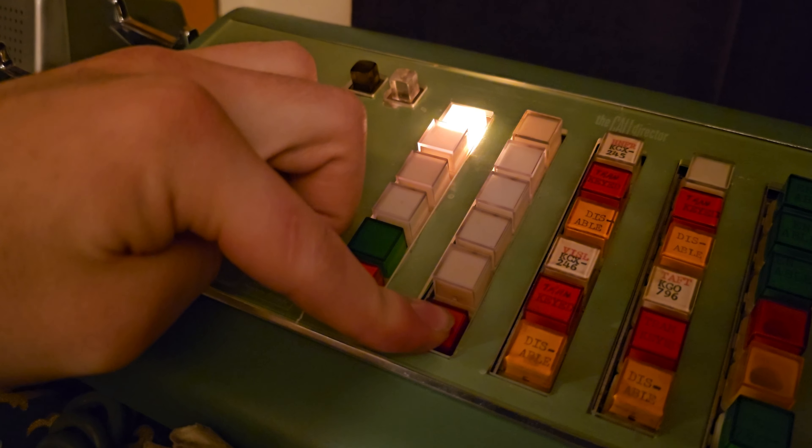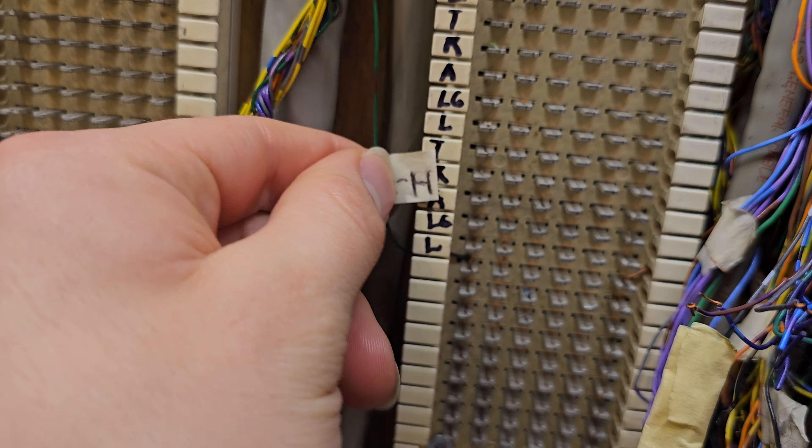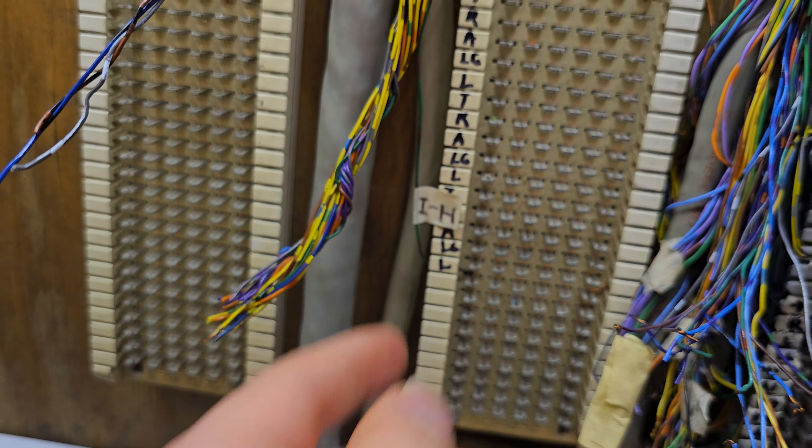The H bridge power for the positive 12-volt is actually positive lamp power. For my system I converted it to DC because there's no need for me to actually have AC power, and I think it's actually safer for the lamps in the long run. So if you're using a system like this you'll have to convert your system over to DC, or go through a lot more trouble of trying to make it work with AC. DC is just safer in general for these circuits.